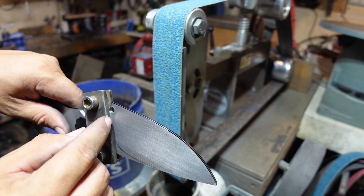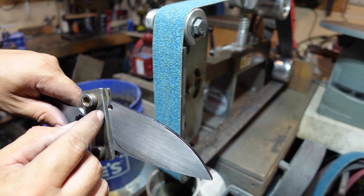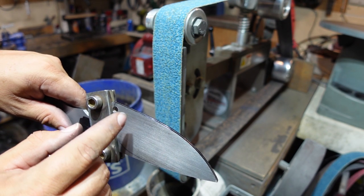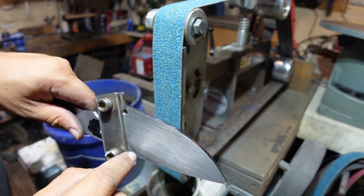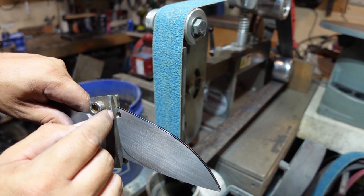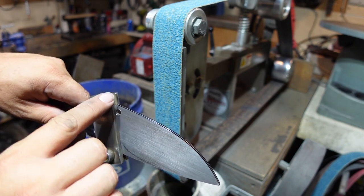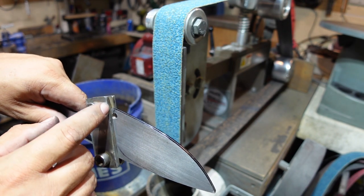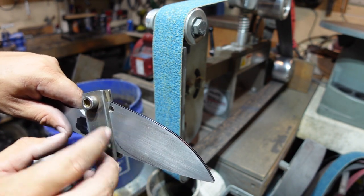If we pulled it all the way back, that's going to make it to where this hole is kind of floating out here. We don't want that to be the case. We want the plunge line to fall straight into the back side of that hole right there. It gives us a nice, cool R shape, as opposed to just a weird looking hole that's just floating.